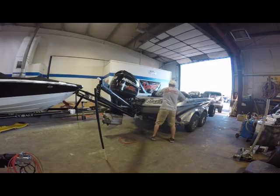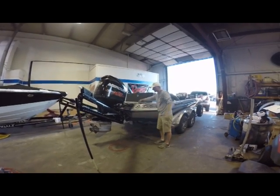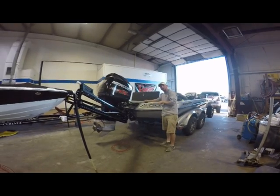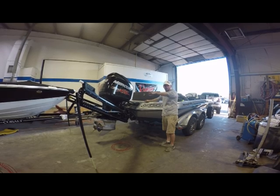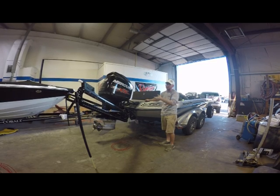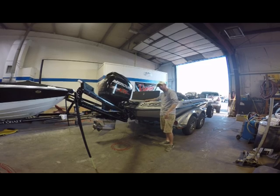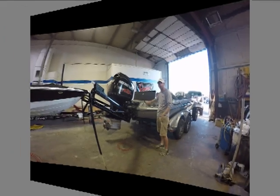Once we've got that fed into the boat, next we're going to unscrew and take the screws out of the rear anchor light base because we're going to tie into it now. Some guys just want to cut the wires and leave it internally like that. I like to tie it in so you still have the option to go back to the factory rear pole if you want, in case something goes wrong. You can splice right into it just like our towing light does.